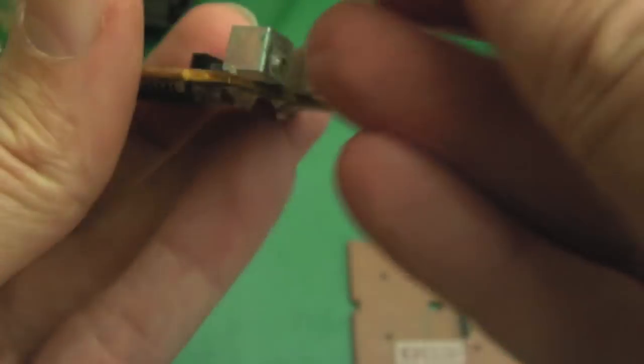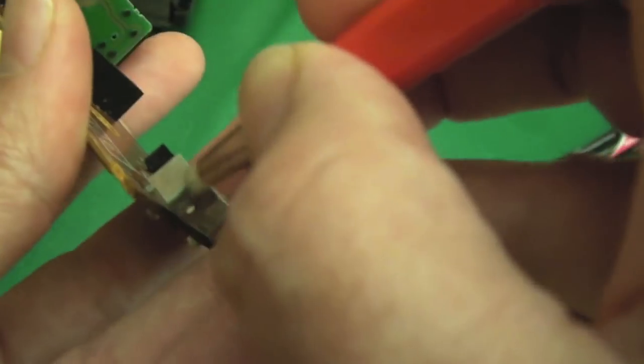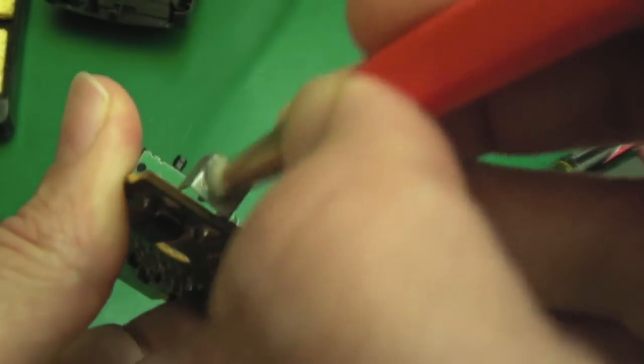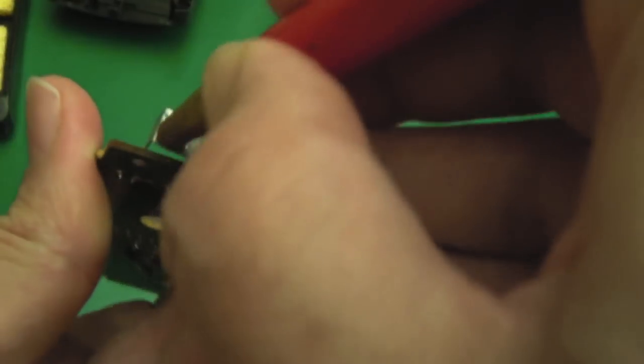So we'll use the fiberglass pen here now. You can tell this is corrosive because as I'm touching these things I'm getting itching on my hands — the alkaline, and since the IPA is there, it's probably a catalyst to make it a bit more reactive and it starts to irritate the skin. So yeah, this does definitely need to be done. A wire brush is perhaps a better thing to use depending on how bad the corrosion is, but I think we can probably get most of it off just using the fiberglass pen — it's a little bit less destructive.